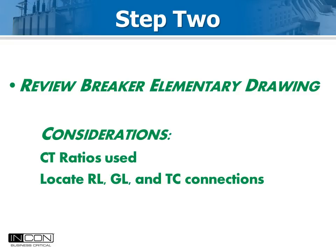The simplest connection for the AUX B input is directly in parallel with the green light. The Optimizer 2 calculates primary current values for measurements on the secondary side. This makes it important to know the ratio of the bushing CT circuit you are connecting the pickup coils to. This value is entered into the Optimizer 2 as part of the setup process.